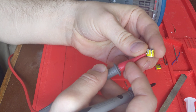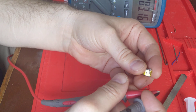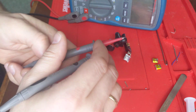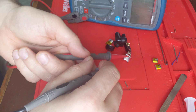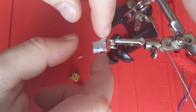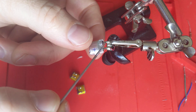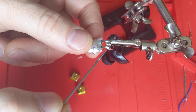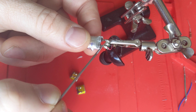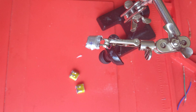Let's see whether for this one it's the same — yeah, the polarity is right also, positive and negative. For both cells the polarity is correct in both positions. Now I will try to unsolder the old ones and replace these. I hooked up this small module with this holder I have here, and I will try to gently unsolder these two wires — these two leads — from this little PCB. Notice there is a red and a black wire. The red is directly connected to the cell and the black goes to some circuitry.